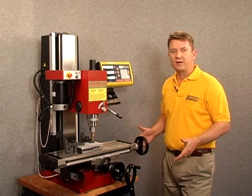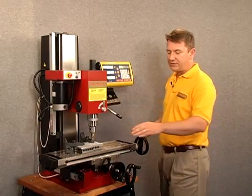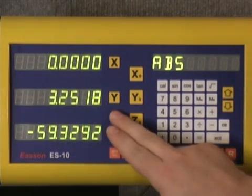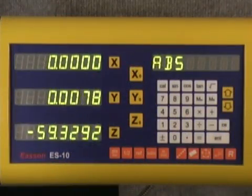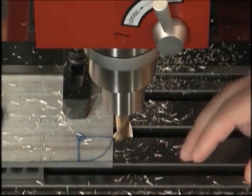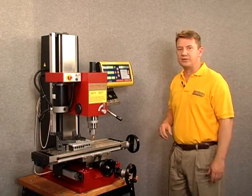I've finished my final cut on the right-hand side. Let's take a look at the display and see where we're at position-wise. I look at my X-axis coordinate and there's a value there, but that's not exactly what I want. I've just performed my finish cut, so let's go ahead and zero that out. As for our Y-axis, let's move it so that it zeroes out and zero out the display. Now we're exactly one inch behind the front surface of our work piece and we're ready to begin the arc procedure.